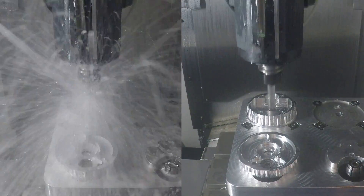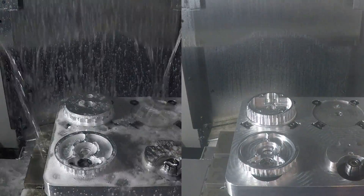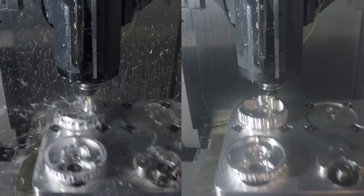We're drilling a 5/8-inch carbide drill. These holes are just so we can drop in and rough out these pockets without needing to do a helical entry.